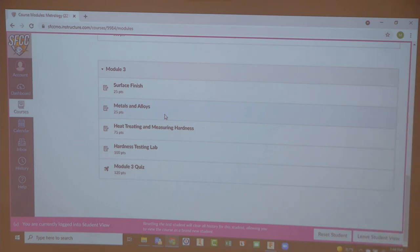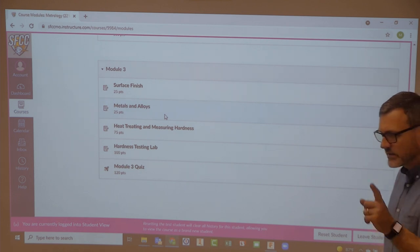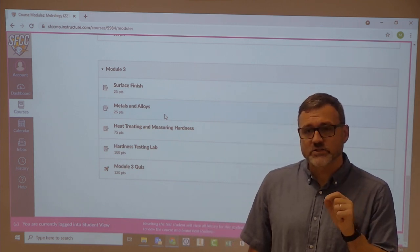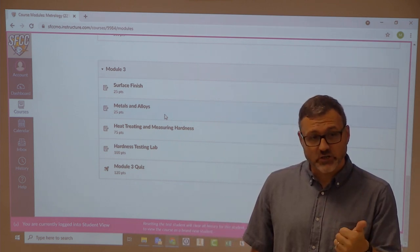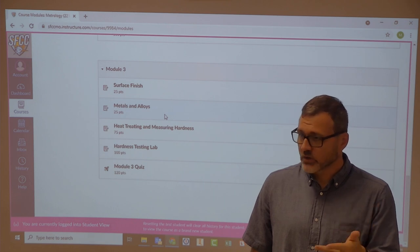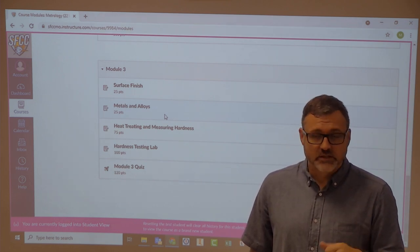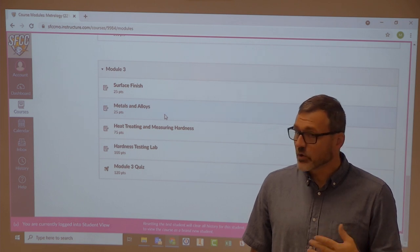So we're going to look at surface finish, and using those two gauges, we're going to look at it. Also on the gauge that you have there, the surface finish is different if it's a turn finish, a mill finish, profile, plain, ground, or flat. So you want to look at the process or what the print says.